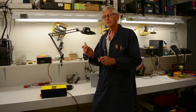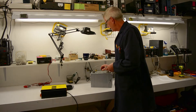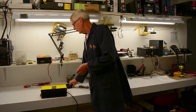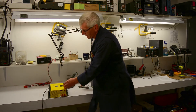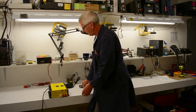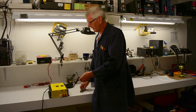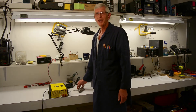The temperature sensor end has a double-sided sticky tape, so just peel that off and stick it on your battery — that'll work just fine. To plug the sensor into the charger, look at the DC end of the charger itself and there's a small receptacle that looks similar to an audio jack. All you have to do is simply plug it in. It's that easy.